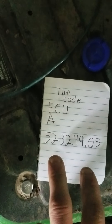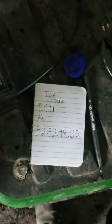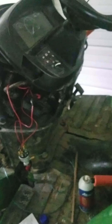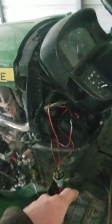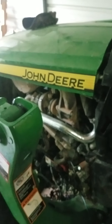This code — what the John Deere told me — was that the crank position sensor is not communicating with the computer on the tractor, which in turn was not letting it start. So guys, we fixed it. I really hope y'all don't have this problem because it has been a real pain in the butt to track down, because it would throw the code and then take it off before I had time to look it up. I hope this helps someone. God bless, y'all have a wonderful day, and don't forget to like and subscribe. John Deere 3038E. Have a great day.